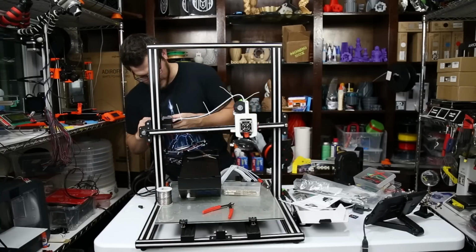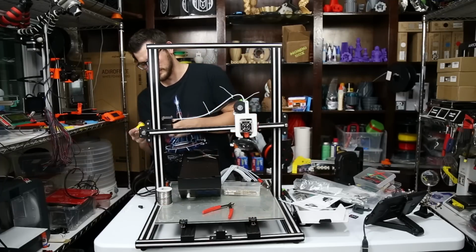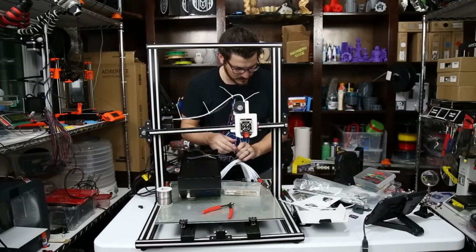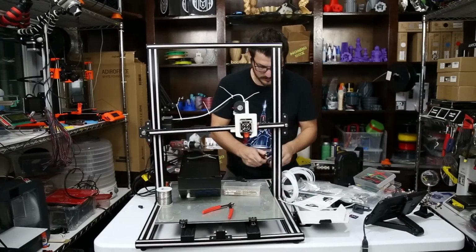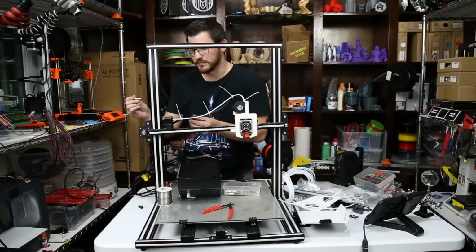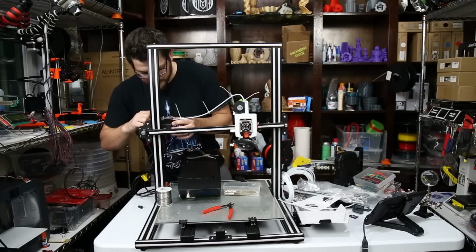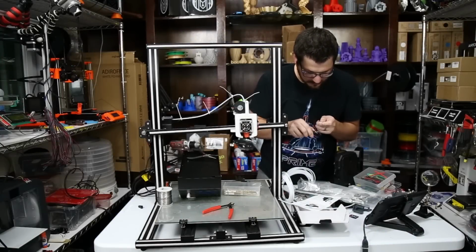And I guess with this, I'll just run the filament sensor, just have it kind of hanging here. It won't really matter unless I can get a piece of PTFE tubing between it and the extruder, because for the Titans you should have a piece of PTFE going in it anyways. That is just to help guide the filament in there, especially with TPU filaments, and they never really fit in there, so I just shave down one side of it a little bit to let it fit in there a little easier.